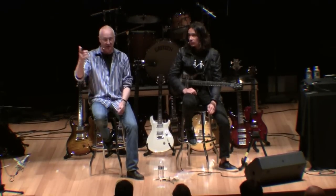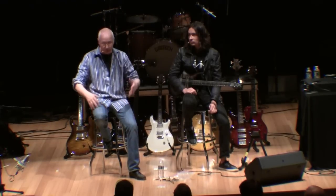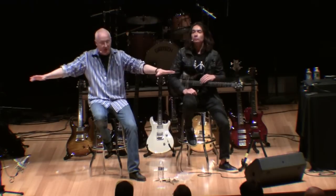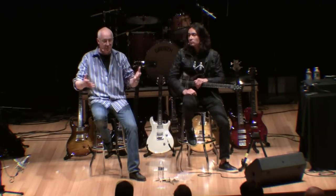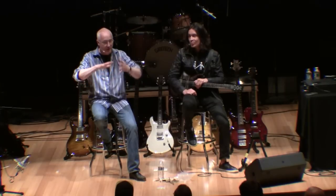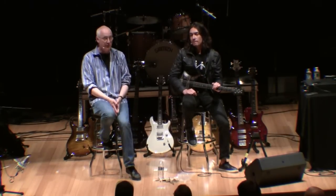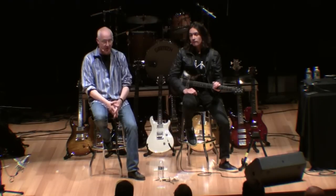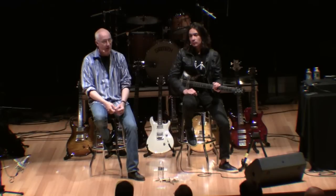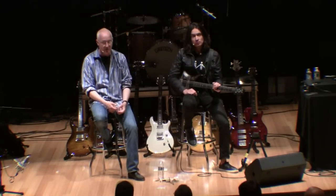One of the ways that we got the S2 necks to be so stable is we're doing it even more. So we bring it down to about 6% water, and then if you have a kitchen table in your house that's been there 20 years, in the spring or the fall, it's about 7% water. It's dried and dried and dried, and it'll pick up some water from the air. That's 7%. In my experience, that's the way it should be. Air drying is to get it to not crack, and kiln drying is to get the water out, and I don't think the way the industry is right now is the way it should be. I think everything should be 7%.